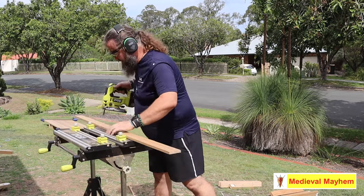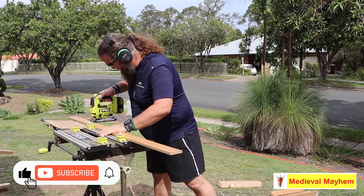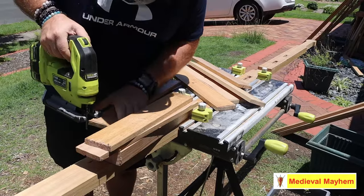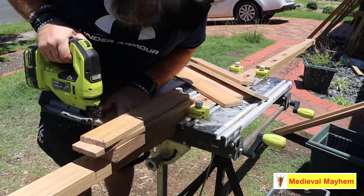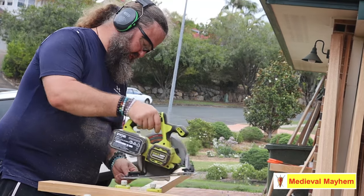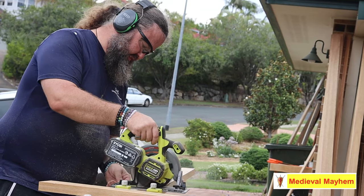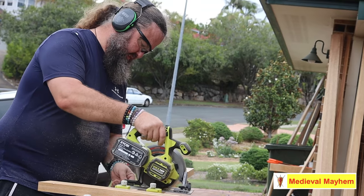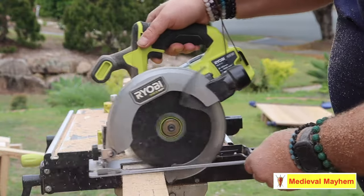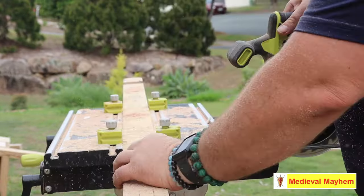In my plans, I decided to go with a cage on the front of the wheelbarrow to give some support as the load goes forwards. To make that happen, I needed to cut some dados and also some mortises and tenons. The dados I just simply cut with a circular saw set to a particular depth — that was really important. That gave me the cage at the front of the wheelbarrow and the legs kind of in the middle.